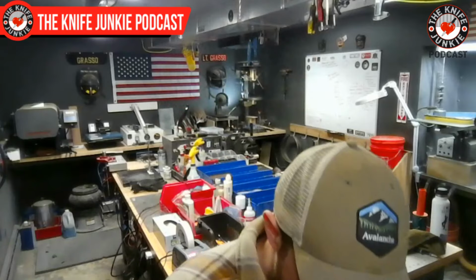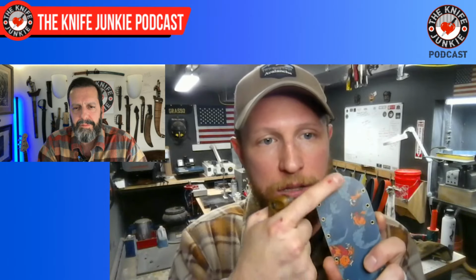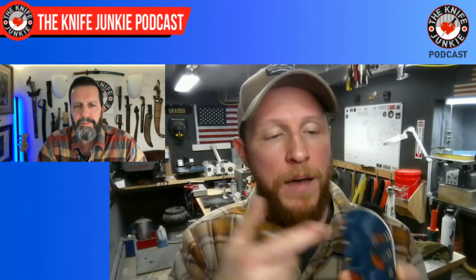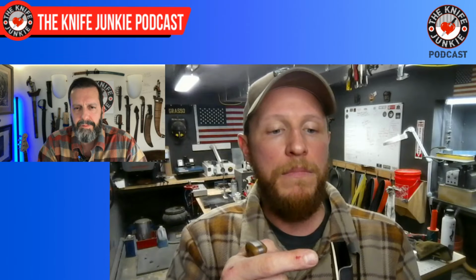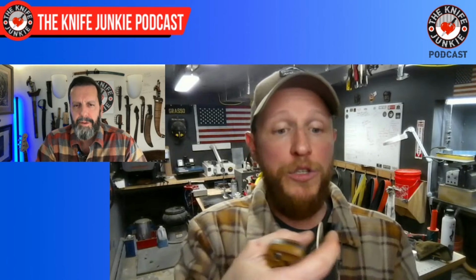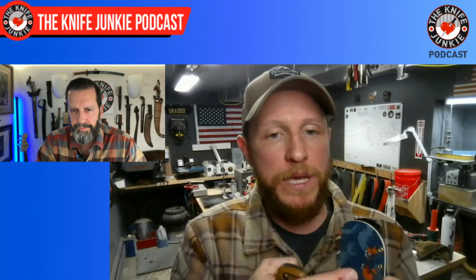Oh, nice. And so what you need to do is take a knife. I have one right here. And you have to heat up gently the back of the Kydex right here. Because you can force this thing in there, but with the dimensions that I made them in the width, it's not going to fit right. You could make this opening wider so it drops in without needing to modify the back. But I found that if you heat up the back of it and put the knife in and gently mold it around it, that's what really grabs the knife and gives it some awesome retention.